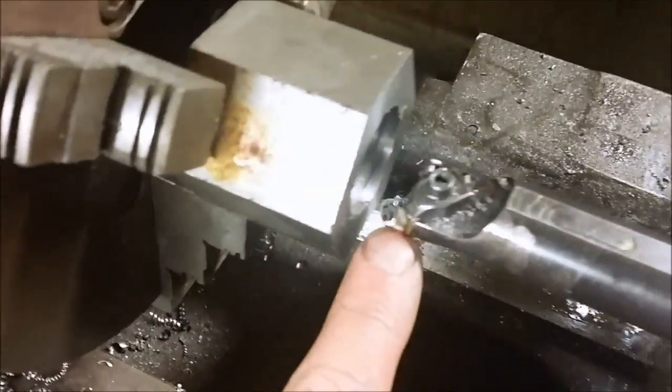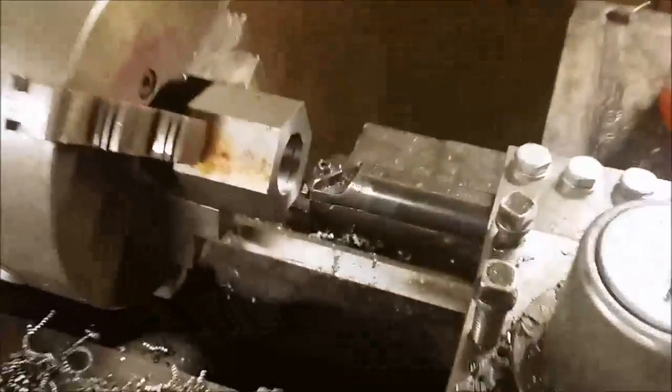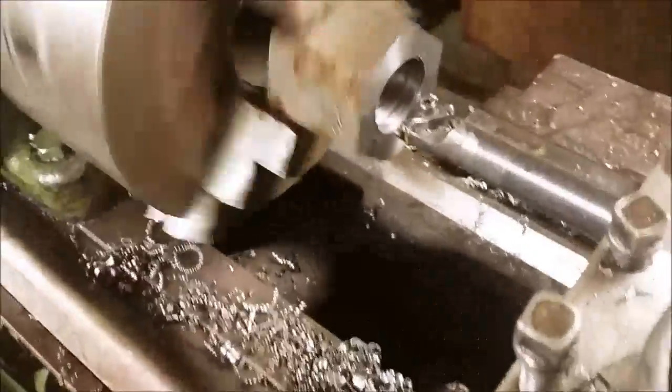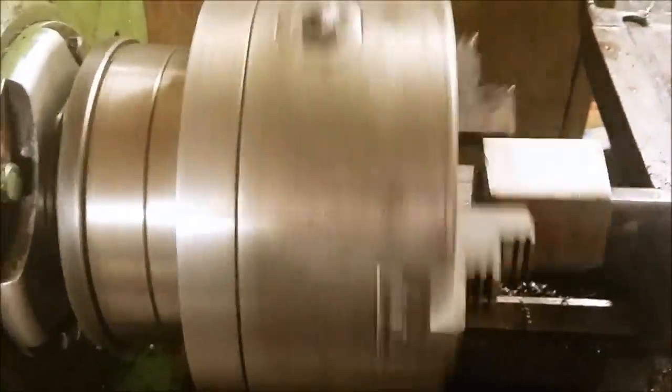And again I have a 6mm pitch and I'm using this insert, which is a little too narrow. So when I reach the depth, which is 1.5mm, and I'm getting pretty close, I'm gonna move the tool sideways so it will make the groove wider. Actually, I think I can show you one pass. Okay, should be ready to go, let's see. It does not take long.